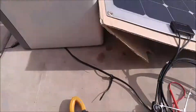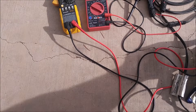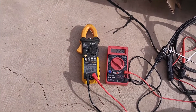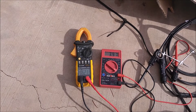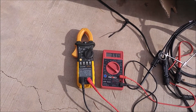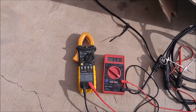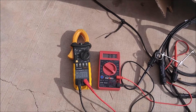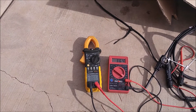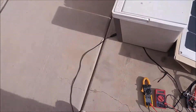I'm going to go ahead and turn on this other 12-volt cooler, and that's going to instantly drop our volts in half. So now we're getting 6.2 volts and 3.97 amps — it cut our volts in half, but we're still getting the same number of watts out. I'm going to go ahead and unplug that again. Now we're up to 10.6 volts, 3.61 amps.